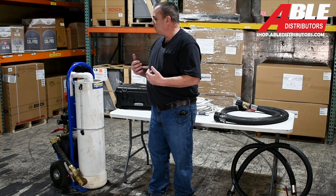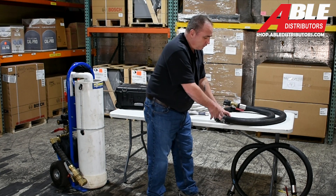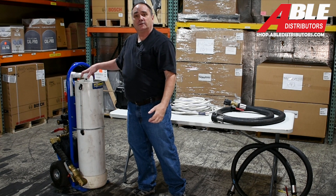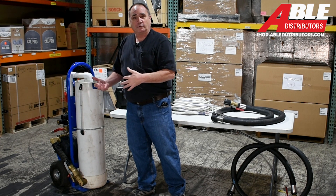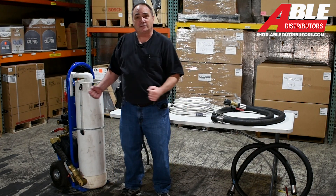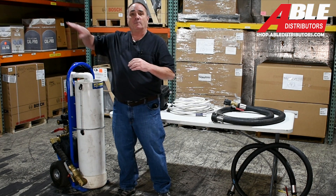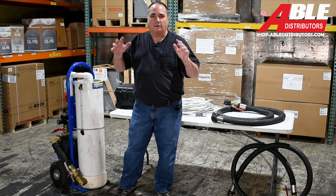It comes with large hoses — two hoses because you're going to push and pull. You're going to push fresh clean water with chemical up into the system, and it comes back through the cart and you dump it, or you recirculate it and work that cleaner through. You're going to need garden hoses to attach to city water to fill this thing up, and a lot of times you're going to do a pump-and-dump, dumping that water into a sewer drain, out on the lawn, or down a sump pit.